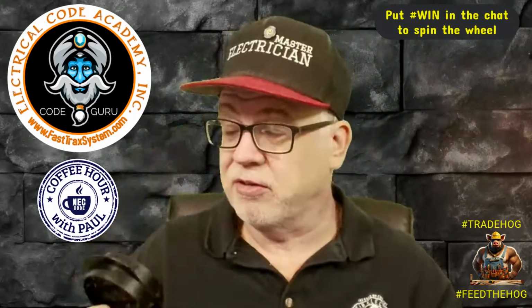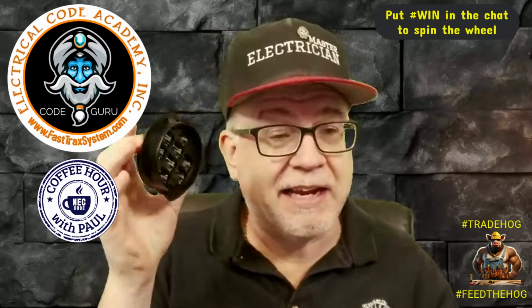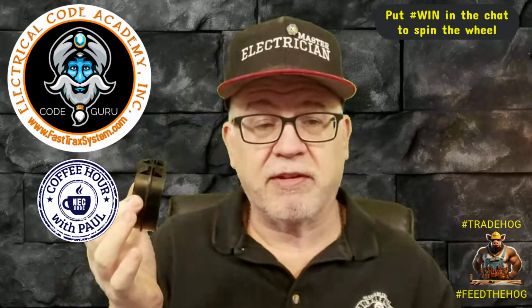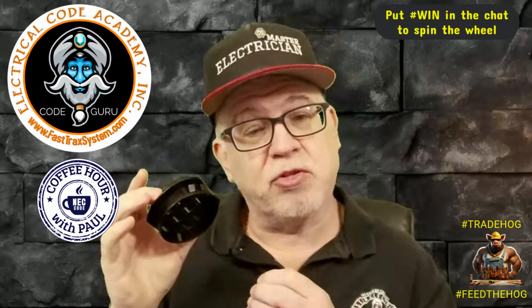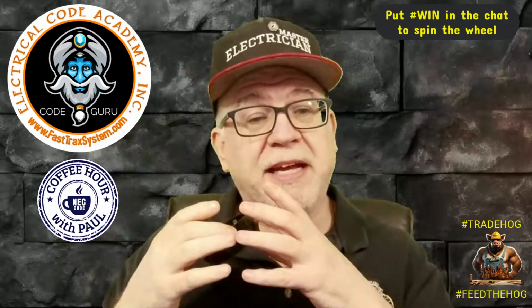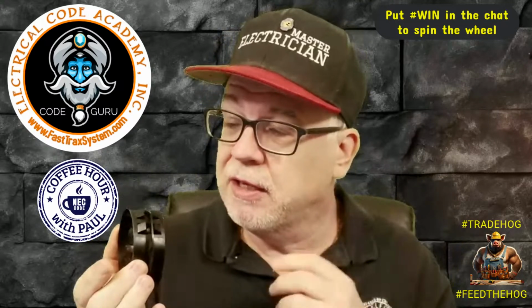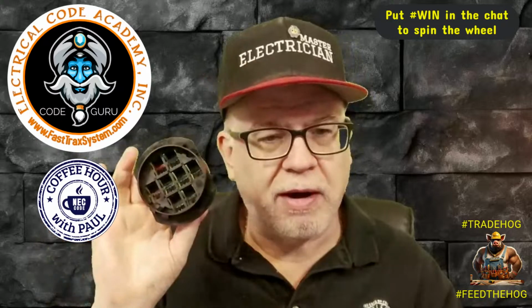I invent stuff all the time, different types of cables, but I didn't think about something like this. At the end of the day, this solves a violation that's very common, 312.5(C), where you're required to secure every cable to a cabinet or enclosure. Well, if you bring them all through one big knockout, that's not meeting the intent of the code. Even though inspectors may let you do it, especially out there in Arizona, that's not compliant. So this guy came up with this thing, and it's called a wire waffle.